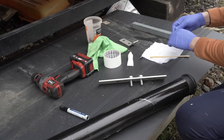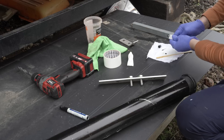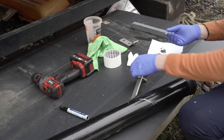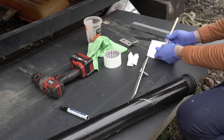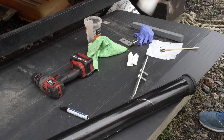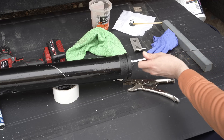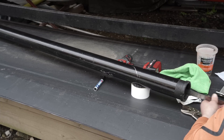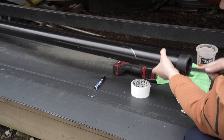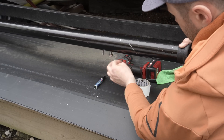I still need the bolts to stay in place and resist rotation, so I'm going to use a ring of JB Weld Original beneath the bolt heads. The 5000 psi strength claim of this epoxy won't be specified for rotational forces, but we can still see what happens. If no good, I can perhaps find an extra long-handled spanner. Due to the access issues, I've duct-taped the bar and bolts onto a metal ruler, and I hope this means I can accurately guide it in. It worked on the first attempt in the satisfying manner you'd expect when successfully misusing measuring implements to insert bolts through pre-drilled holes. What a world Alan and I have created for ourselves.